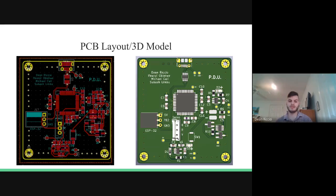So here's the PCB that me and Gerald have essentially laid out. It's a 4-layer board, and we were able to determine the layout through some research along with the trace widths needed to ensure current and functionality of each component. And also by reading the data sheets and the recommended values, we made sure to label the components so that if there were any issues that occurred when building the PCB, we could easily troubleshoot them.